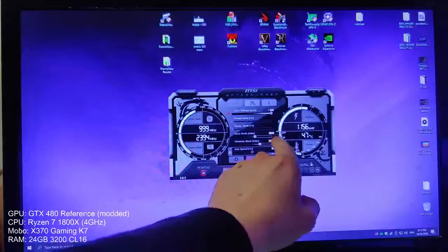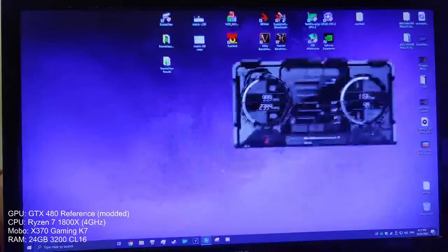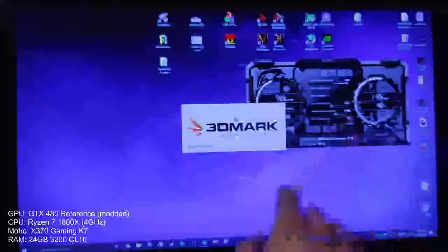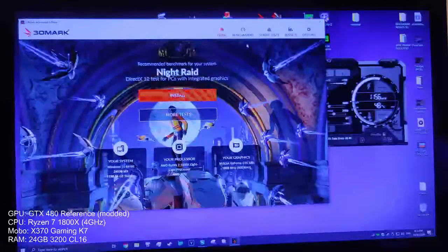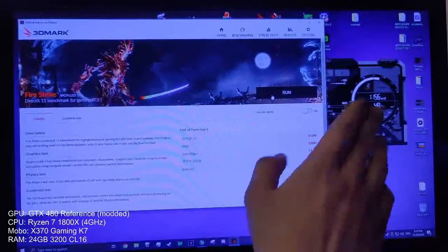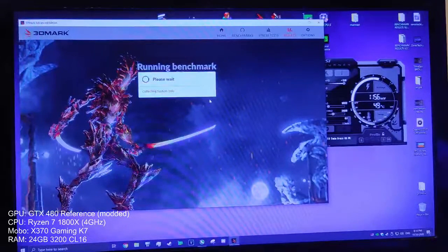It's gonna run 1 GHz on core and 2400 on memory, which might sound like a lot compared to the 480 we just ran. On core, yeah, like 1 GHz on air is not doable on a lot of cards, especially with just 1.13 volts behind the core. The memory with 2400 megahertz, that's actually not that fast compared to the other Lightning. Like I have another Lightning that actually completely fully works and also is identified as a proper Lightning. So it has those extra capacitors. That one does actually run worse for core, but it does run 2550 memory. So yeah, this card's memory is not that great.